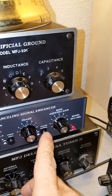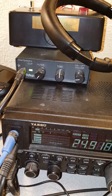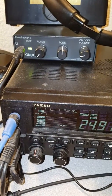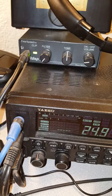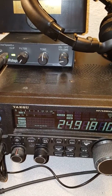The next thing we do is flip the phase from normal to inverted by moving this button out. Now I start decreasing the phase and I can see already the noise is decreasing dramatically. It's below S3 already. I then take the auxiliary antenna gain and tweak it slightly to match it up exactly, making minor adjustments. Right there looks pretty good — we're about S2 to S3.